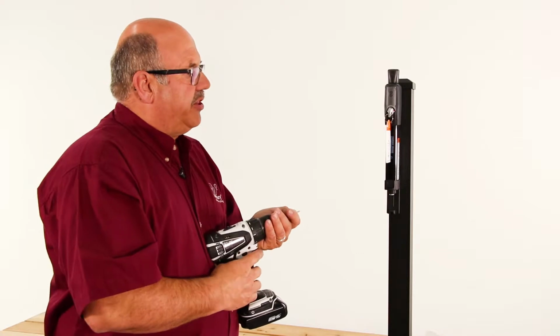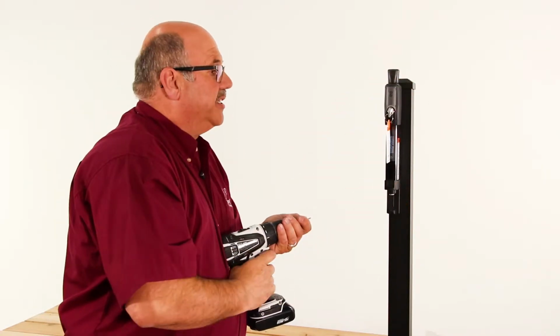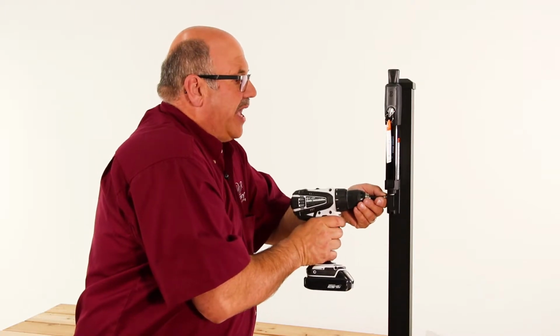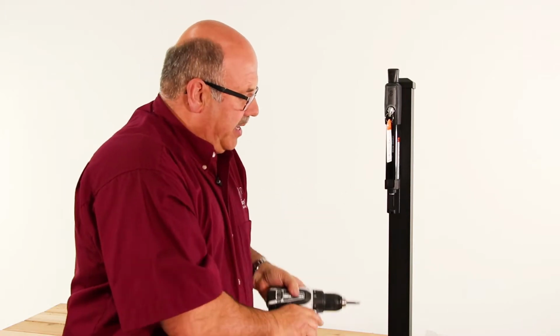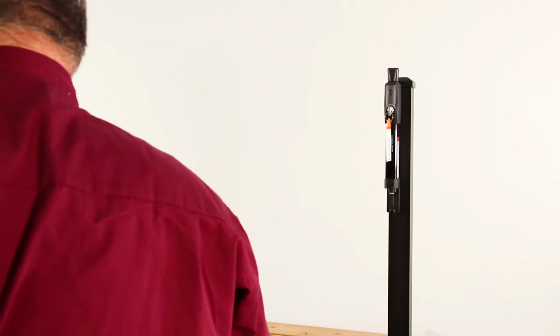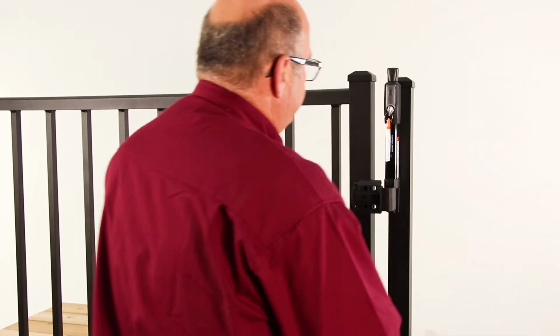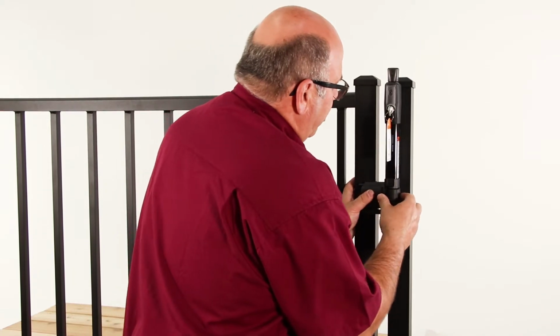Two final steps here on this Magna latch installation. If we recall, this latch body slid over 2 brackets, and we need that securely fastened. So this is a side entry screw to secure that. We're now ready to close the gate, and put this cover in place to hide all the hardware.